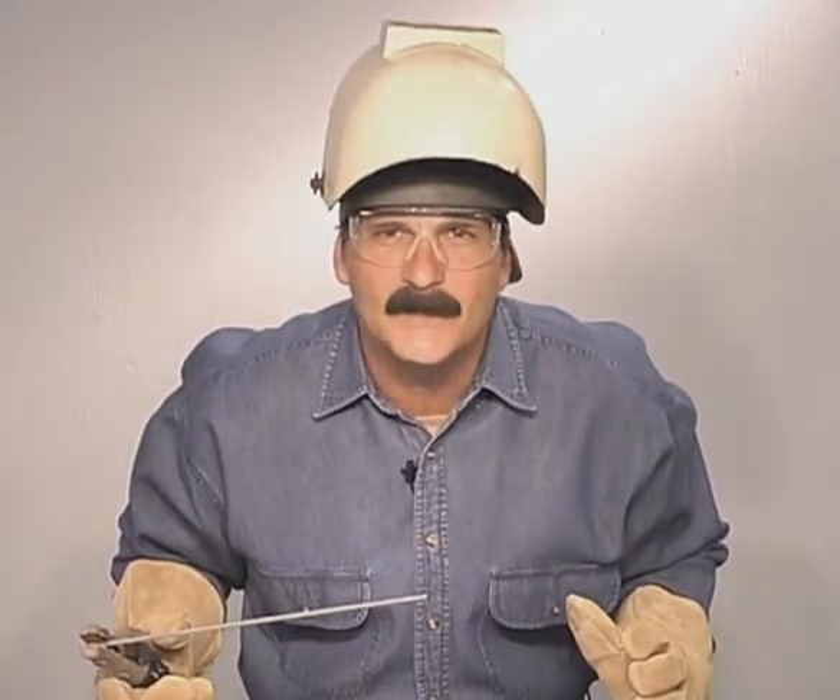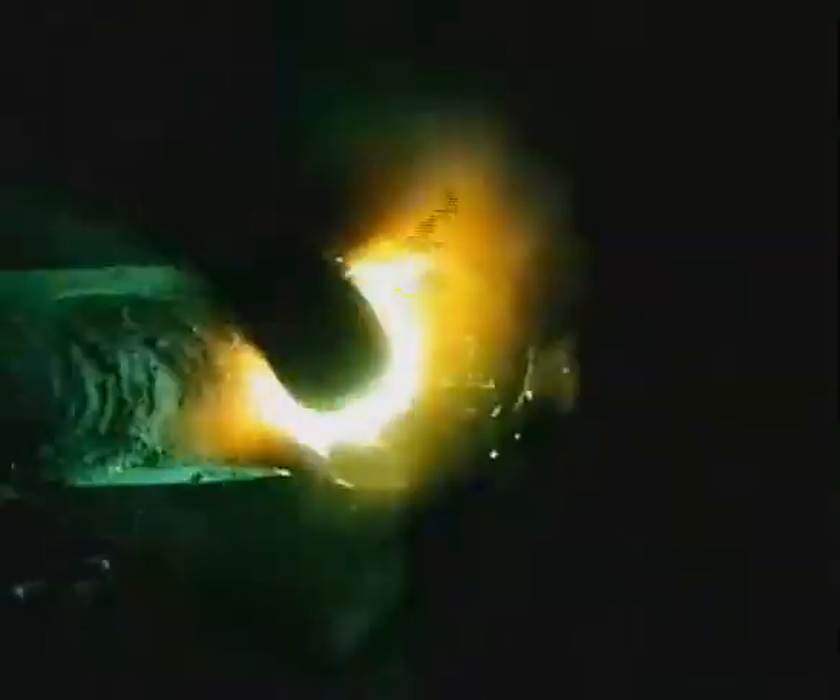I hope I've given you an idea of how to put two pieces of metal together. There are many more options in metal preparation and fit-up to provide for penetration, limit the effects of the metal drawing, and reduce the amount of filler metal deposits. Regardless of the type of weld joint you're working on, you need to experiment with the amperage, rod angle, and travel speed, learning to control the amount of weld deposit. Make slight adjustments in the travel speed when necessary to maintain the puddle, and use the rod angle to control the shape of the weld build-up. Focus on the weld puddle, watching the sides tie in and keeping the filler metal from overheating. Above all else, take your time, have fun with this, and work safely!